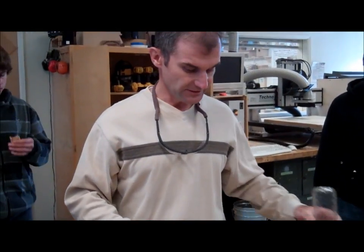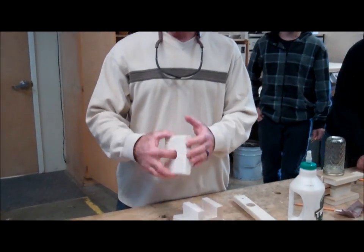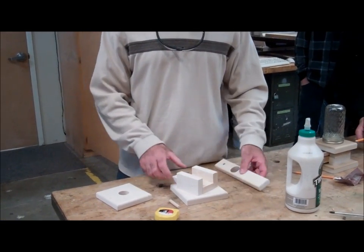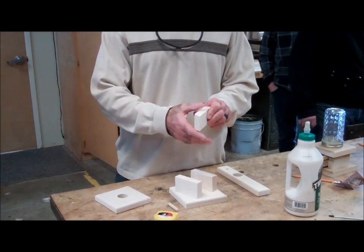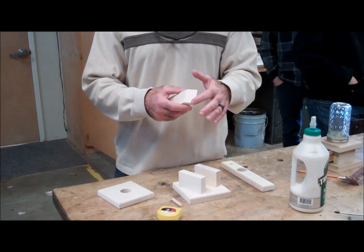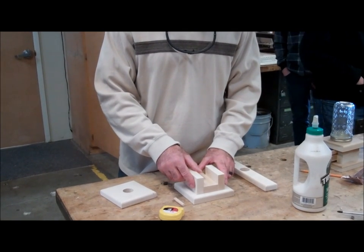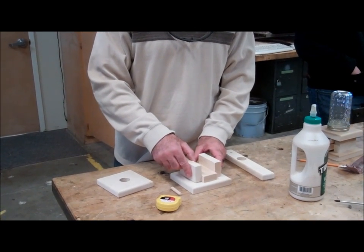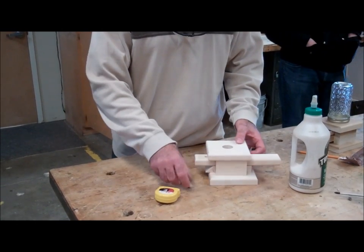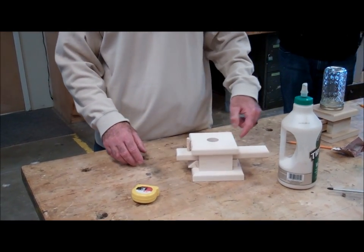Here's our candy dispenser — we've cut out all our parts on the CNC router. I used a hand router and routered the top block on both sides, the bottom block only one side, and the slider on all sides. Then I went to the chop saw and made that 45-degree cut, then orbital sanded with 120 and 160 grit, and used a 220 finish sander. I want to dry assemble first to make sure everything works: the base goes down, this piece drops in, the top block goes on top, my dowel drops in, and when the slider pulls all the way back these two holes should line up perfectly.